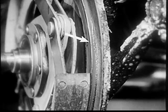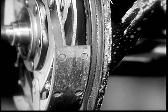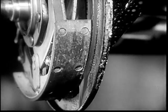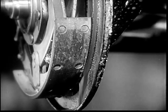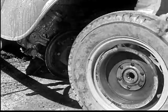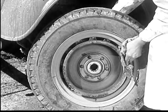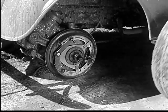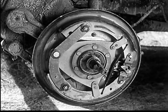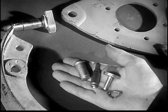Another mighty important part of the brake drum is this flange that protects the lining from wear. This flange forms a little gutter in which water and dirt are collected when they enter at the top of the drum. The mud and water are carried around to the bottom side where they run out. In this manner, the brake drum and lining are kept clean and dry, so this seal ensures smooth and efficient operation in all weather.